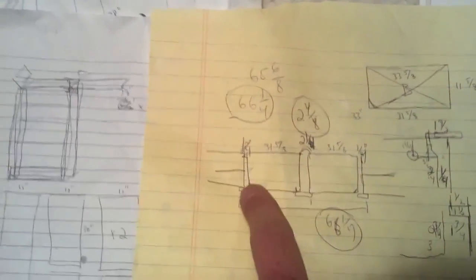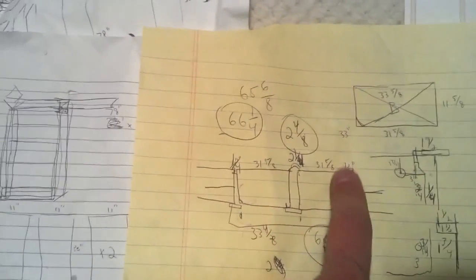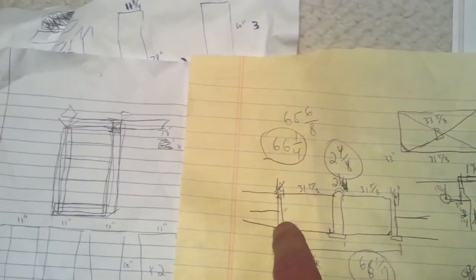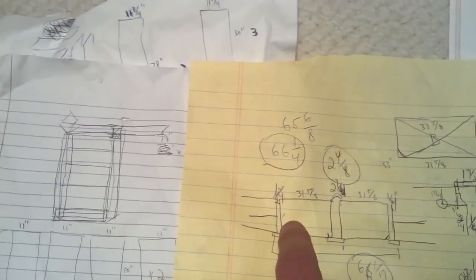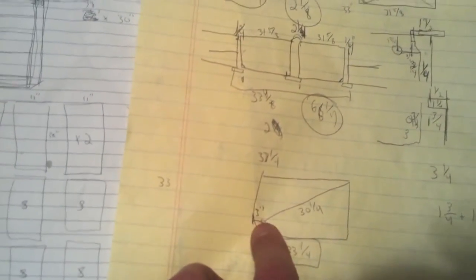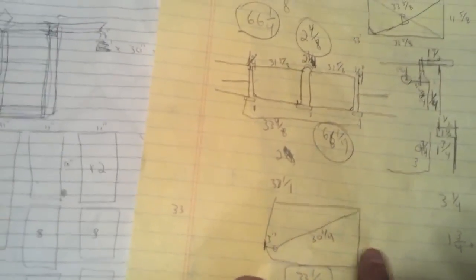Then there are various engineering handwriting drawings. This one shows where I was trying to figure out the amount of drywall and where to put all the holes — I hate doing drywall. One of the more difficult aspects of French doors was all the spacing: you had to figure out how much space to put on the left side and right side of the opening, then how much space that would allow between the two French doors, and then when one was open, what would the distance be between the hinge on the left side and the other door. As it opens it creates more space, and you can see drawings around the distance between the hinge and the corner — those two distances added together give you the total distance.